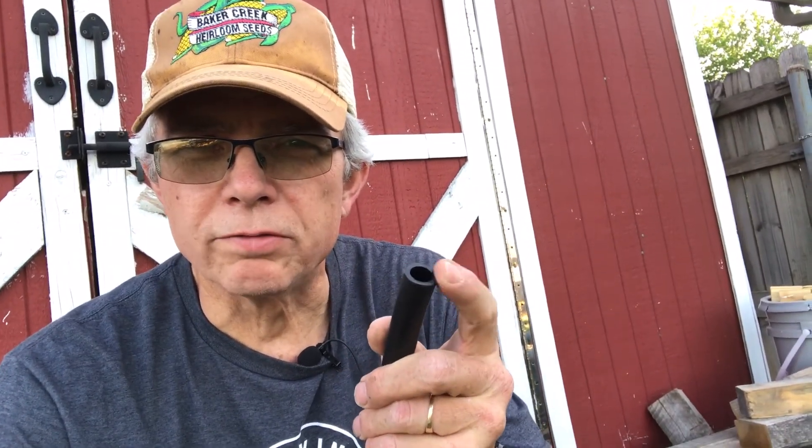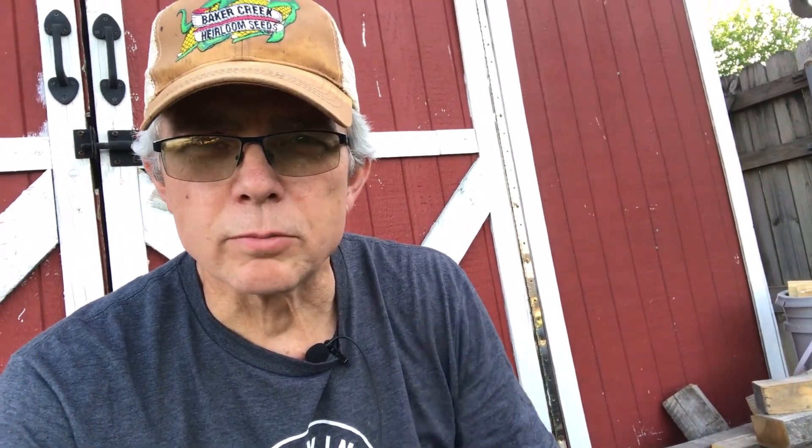The thickness is significantly different, so much so that a lot of the connectors won't fit in because the inner diameter ends up being significantly less than the normal main line. So you can't just go grab any main line — it's got to be the thinner-walled stuff, otherwise it won't fit into all your adapters.